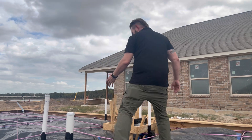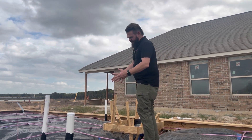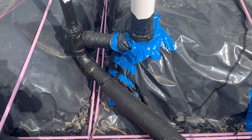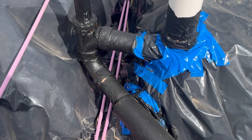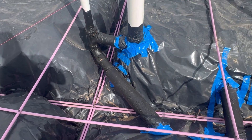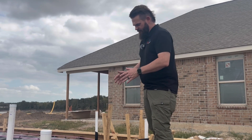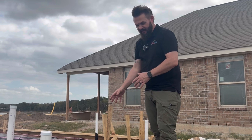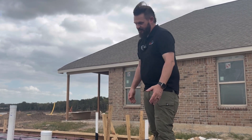What we have here is another plumbing pipe going through the beam, and this is just a poor design. We've sleeved part of it, but this standpipe is going through the beam with mastic on it but no sleeve — there's nothing to protect it. Ideally, these should not run through beams. They should be placed in the middle of one of these pads so that anything exposed to the concrete is sleeved. This can't be done here. So this really is just a poor design.